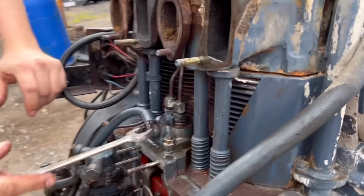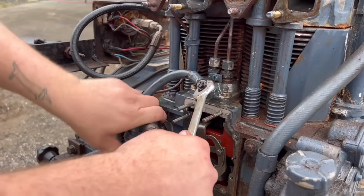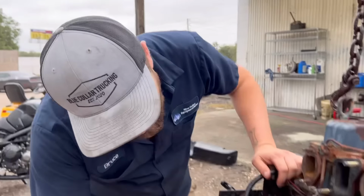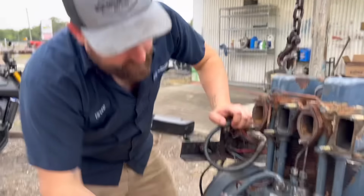All right, folks. We've got our governor exposed here. We're going to get this fuel system primed up here again. We've got fuel up there. We're going to spin it over. If it's at full throttle, I'll try to idle it back down and shut it off maybe. Let me go get a pry bar so that we can then put the governor back over it.